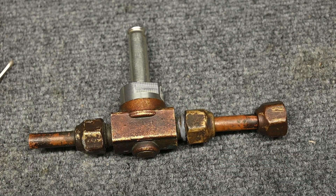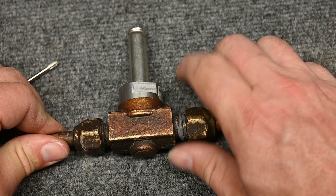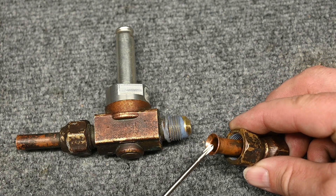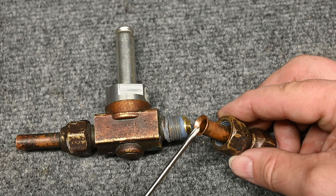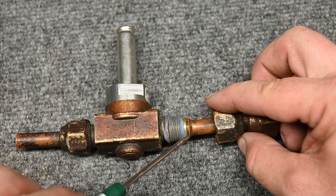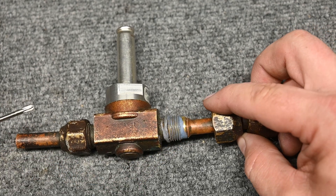The catch is that the copper on the end where we make that flare is essential — that is the seal of the system. If this piece right here is not done correctly, the whole entire thing is going to fail. This is soft copper, so as it squeezes against the brass it fills in all the little impurities, and that's what makes the seal.